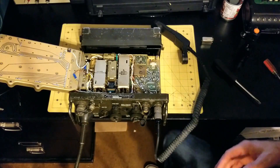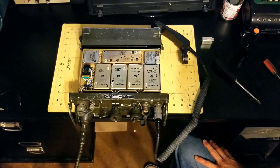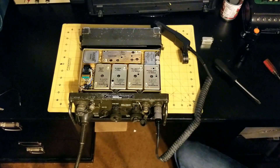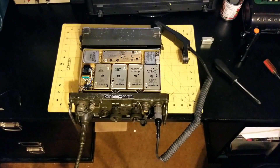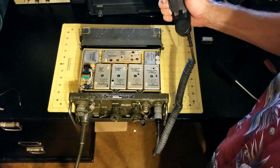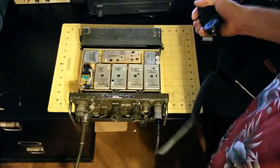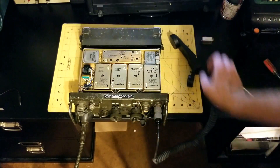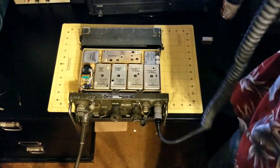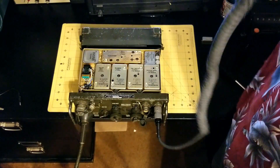The known good module is in. Let's reproduce the test — here's the repaired unit. Now when I transmit: come in, come in, keep the base, do you copy? I'll go ahead and do a squelch set up. Do you copy? Do you copy? I got a good copy — I can hear myself transmitting in the other radio, set in squelch mode as well.